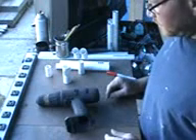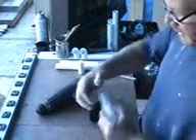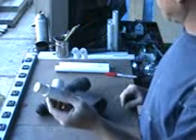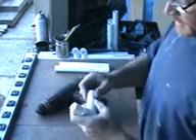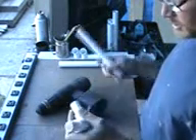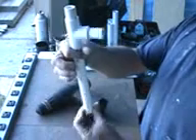It's real simple. All we do is start off with the T. Take a little small about two and a quarter inch piece and shove that down on the top. Then take another piece about two and three quarter inches — correction, take that one back out of the bottom and stick it into the side. Then we're going to go with a bigger one at the bottom — a longer one — because this is the piece that goes down into the steel pipe and sits on there and makes a pivot with the wind.